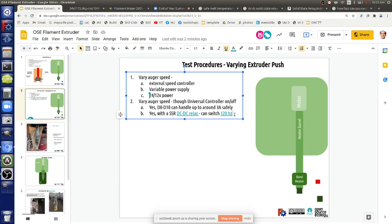If we go through that relay, we just read the specs. It says you can switch it only up to 120 hertz. Could that be sufficient? I mean, at 60 hertz you don't see the flicker of a light, right? It's smooth. It would be a smooth control if you've got access to 120 hertz or 60 hertz even. Okay, so we can control things here.